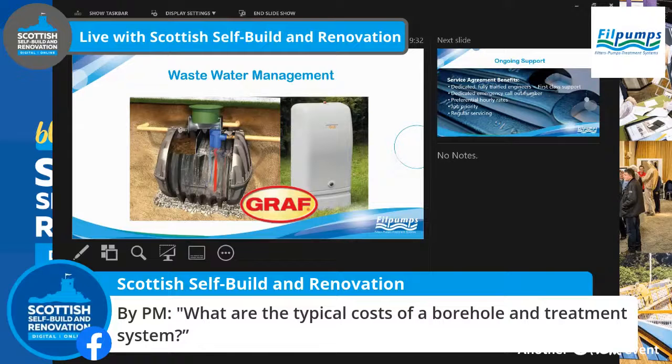What may take multiple treatment tanks to achieve with other systems, the One2Clean can achieve in a single tank. With no mechanical or electrical elements or pumps involved in the wastewater, it is highly energy efficient and suffers less wear than other wastewater systems. It also leaves very little sewage sludge at the end of the process.